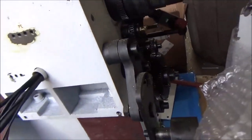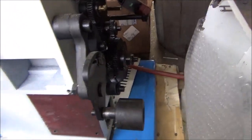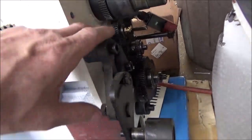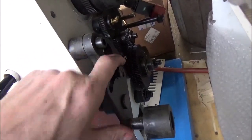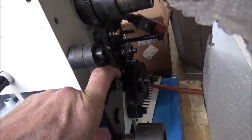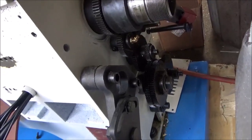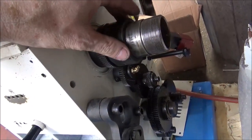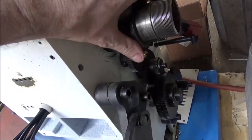These are the change-out gears back here and this is a belt tensioner of some sort. Pretty much most of this stuff here is going to come off. I may have a belt tensioner — it may be one that's spring-loaded to keep tension on it. I'm going to try to go with a serpentine belt if I can. That's why I took this pulley off — so I could get some measurements and see what I could find for a serpentine belt drive.